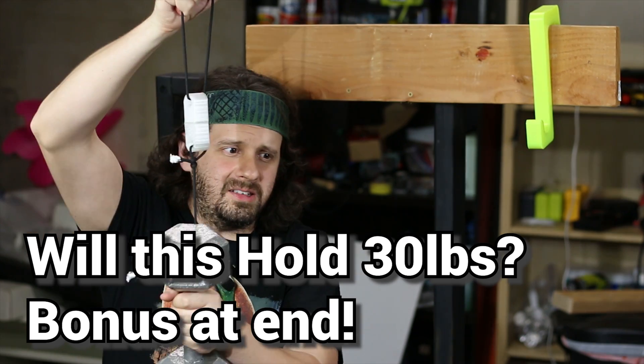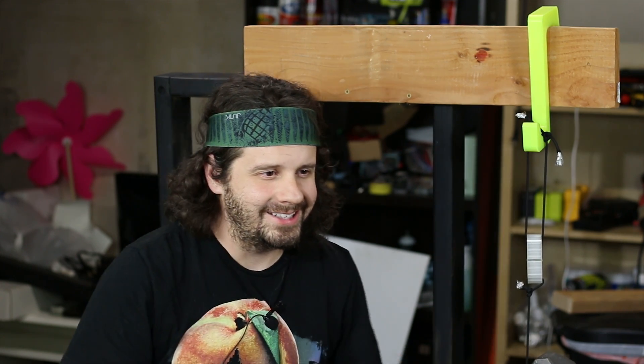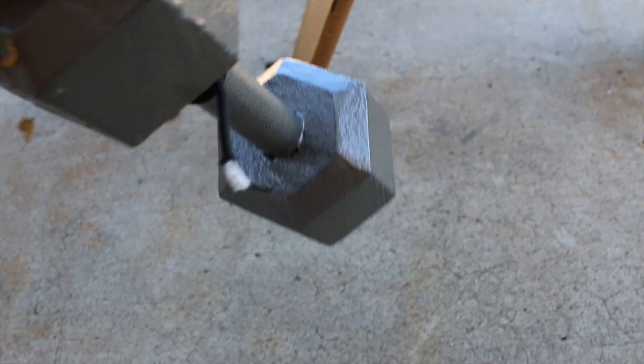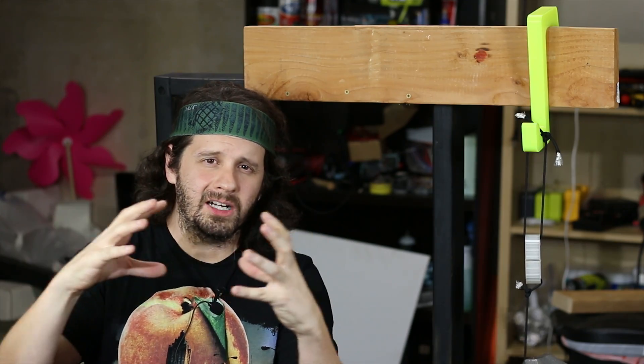I'm a little afraid to let it fall in my lap, so we're just going to put it on this hook. Everything's tight — and wouldn't you know it, it's outside the frame. Just in case you couldn't see: 20 pounds. I tested this twice and it held for a few minutes. This is the DP-105, which isn't specifically designed for high-strength bonds over small surface areas — it has a little flexibility for temperature change, to join two materials with different properties using the slight gumminess of the epoxy. But this is a testament that it actually works.